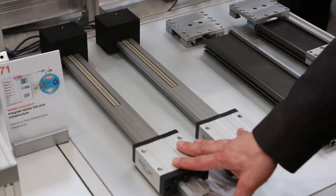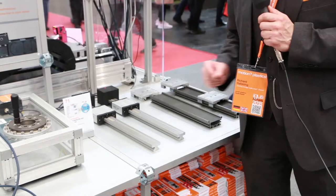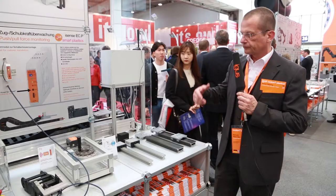Sensors are able to integrate in nearly all of our products. For example, these are two driving T-guides and we measure at the end of the rail. You can see this one is fine, but this one is at the end of its lifetime and the gliding parts need to be changed.